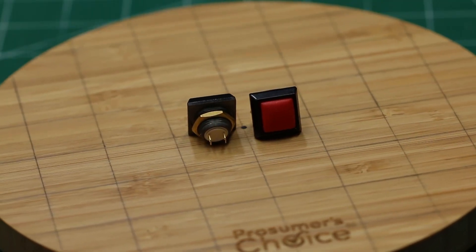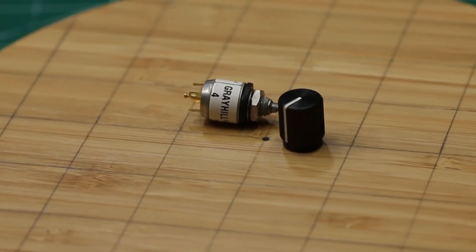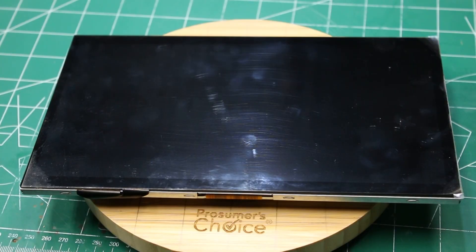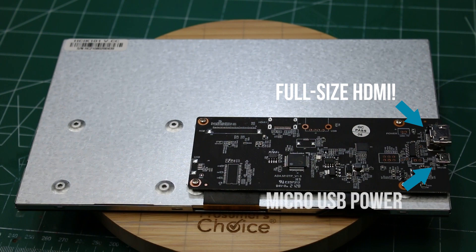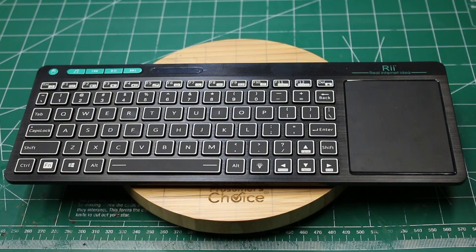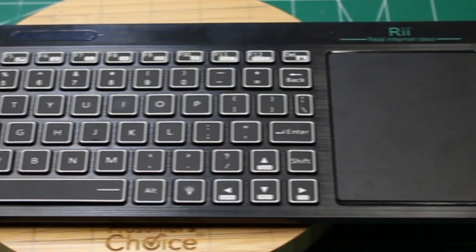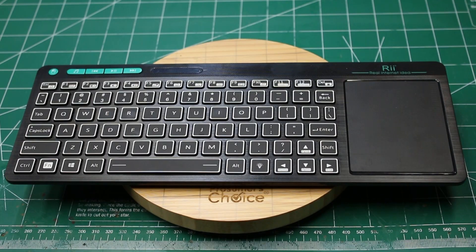These are the ITW 59 series push button switches, which will control forward, backward, left, right, up, and down. I'll use this four-position rotary switch to select which axis the rotary encoder operates. I only have three axes on the machine right now, but there is an option for a rotary table that I could add in the future. This is a 10-inch capacitive touchscreen display — it's got HDMI output and it's powered by USB, so it's perfect for this application. Apparently a small keyboard with an integrated touchpad is pretty rare; they're about four times the cost of this wireless one that I picked up for pretty cheap.